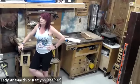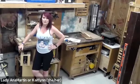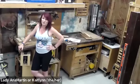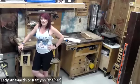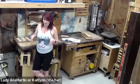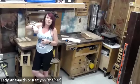An excellent example of where those forces really all come together is a camp bed. Rope beds are very romantic and they look great and they are not comfortable. It's like sleeping inside a tostada, especially if you've got a mattress that is like a futon or an air mattress, or, God help you, if you're on a feather bed. There are ways to get around that, but really, if you're just looking for the look of it, use knockdown joinery for the bed itself, and then put slats underneath. And then just do fake rope on the side.